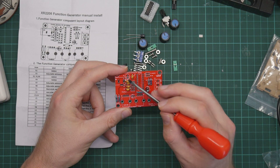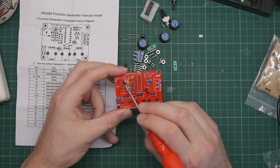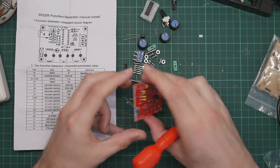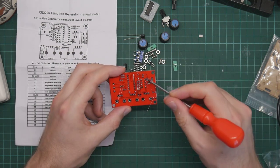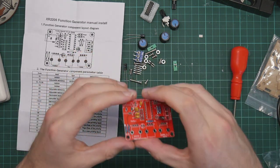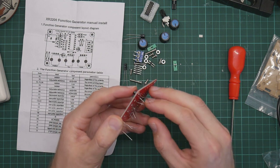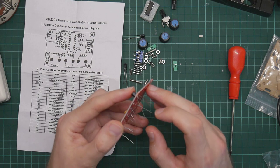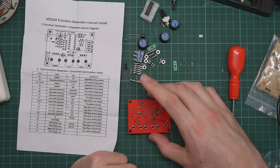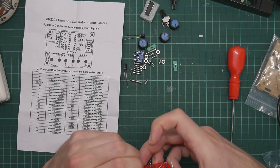Yeah, right. So the striped side is connected to the ground plane, which must mean the negative side. This one here is the positive connector from the power, which should be connected to that hole there. And there it is. So yes, striped means negative. Although it is possible it's a center negative jack, and instead of having a ground plane, there is in fact a positive voltage plane, but that would be really weird, so I'm just going to pretend that's not going to happen.